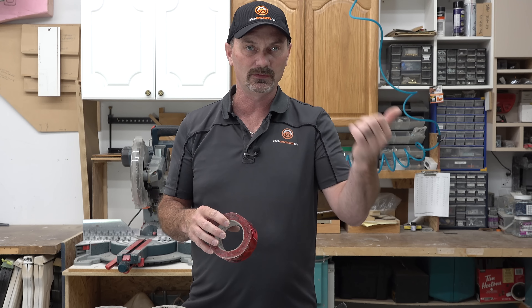The white tape — blue is for vapor barrier, red is normally for house wrap. I like to use the white for some house wrap situations where I'm wrapping and sealing my house wrap to a window frame that's PVC or aluminum, or a door frame, or even sealing it to plastic J-channel for vinyl siding. I like to use the white because it doesn't show up as easily as blue or red does if you happen to get it outside the covered area. The white just doesn't show up as much, and I've never had an inspector say I can't use it.